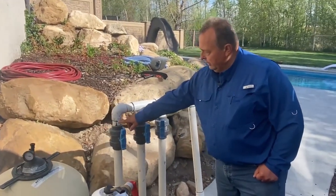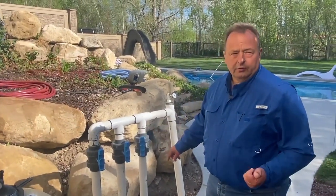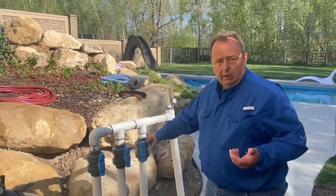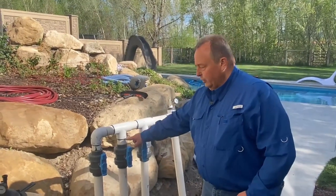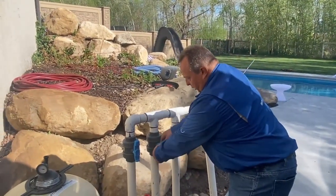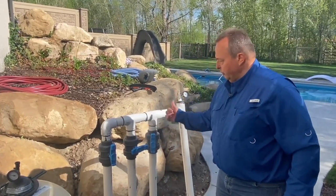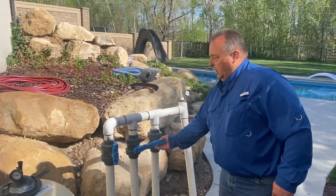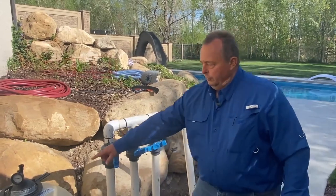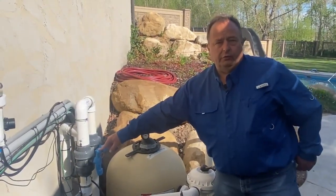Now you need to set the equipment. We set our pools up with a skimmer, a vacuum, and a bottom drain. A lot of pool companies don't put bottom drains anymore because it costs too much time and takes too much effort. We do bottom drains so that you can pull the cold water off the bottom of the pool and heat it, so when you get in the pool the temperature and the water is all the same. Since we're not going to be using the vacuum port at this time — if we're going to use that for the automatic vacuum — you just simply turn this closed. Since we're going to be pulling water through the skimmer, we want to have as much pressure as we can coming through the skimmer, so we're going to partially shut the bottom drains down, creating more of a vacuum to pull all the dirt and debris through the skimmer, through the sand filter, and back to the pool, making sure our return is all the way open so that we have proper water circulation going back into the pool.